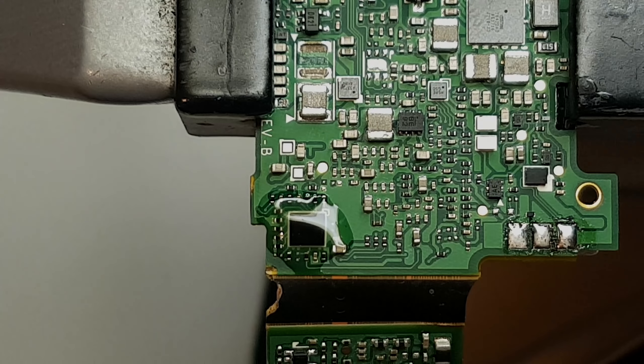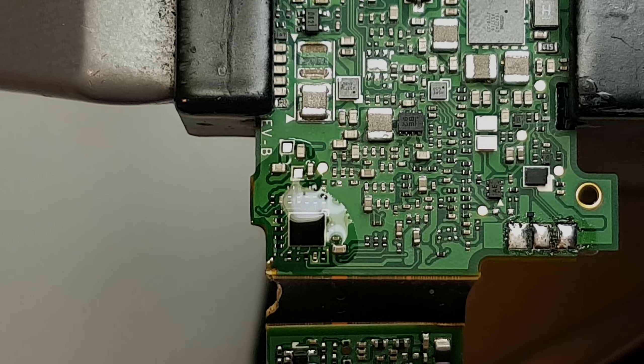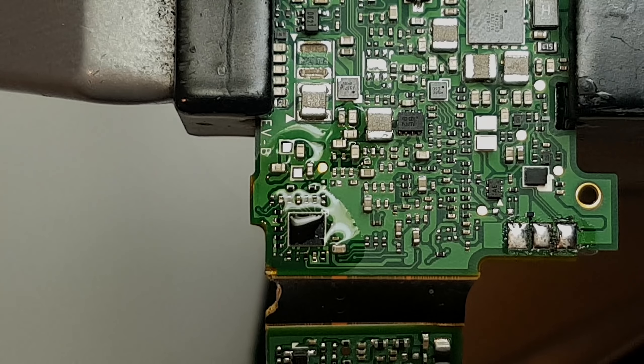As I was explaining in other videos, I will try and heat up the board from a distance, just to ramp its temperature up. That's because if you go in close from the start, you can create some thermal shocks that the components don't like. This is why I am going in from a distance, heating up the board evenly. I can't tell you exactly how I feel that the board is okay to go in.